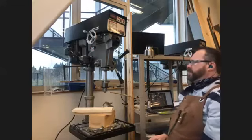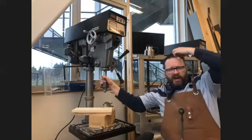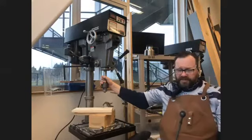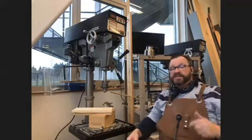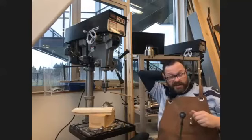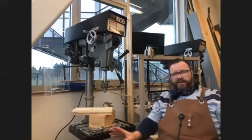If your hair gets wrapped up in this machine, it will literally grab all the hair and pull the root along with the flesh out, leaving a big bald spot on your head. So if you have long hair, necklaces, or even the drawstring ties on your sweatshirt, those things need to be tucked in. For your hair, you can put on a bandana, tie it back, tuck it into the back of your shirt, use a string, a band, or a scrunchie — it's got to be packed and out of the way.